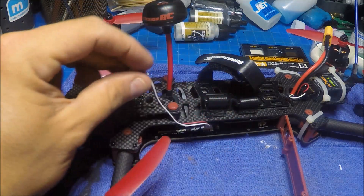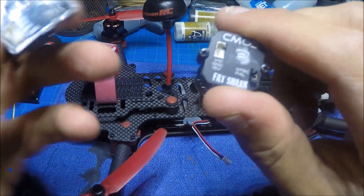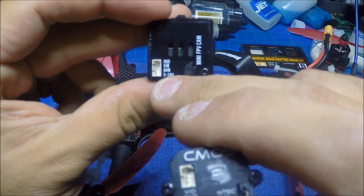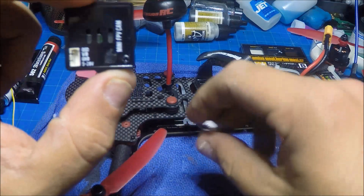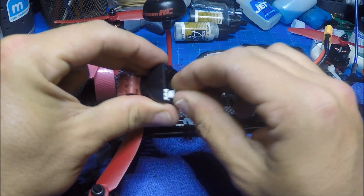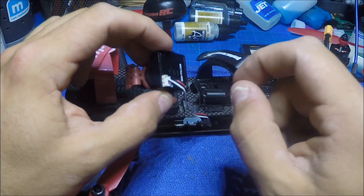This right here is the actual cable coming out, and if you look at the back of the camera you have 5-volt, ground, and video. If you look at the back of the surveillance camera you have 5-to-20-volt, ground, video, and OSD. As luck would have it for people that hate soldering, there is no soldering needed — this will simply push right into place and click right in. You'll have a little bit of a gap left over but it's no big deal.